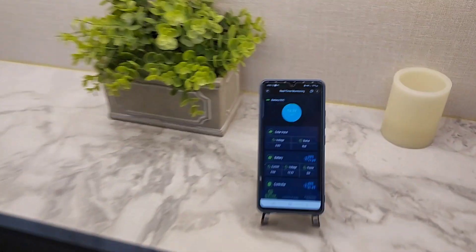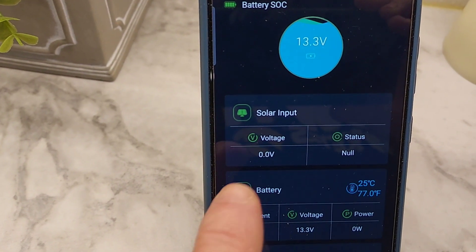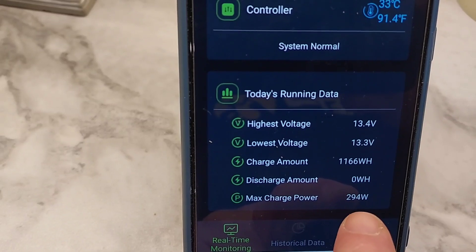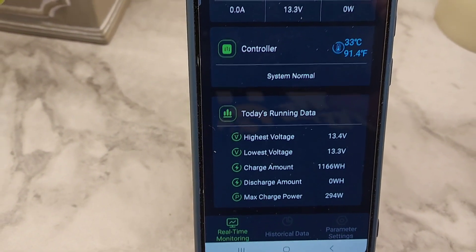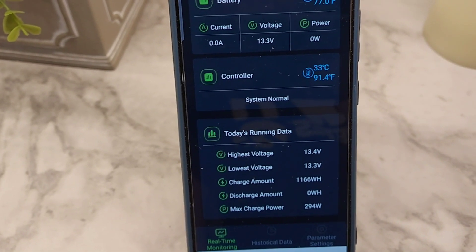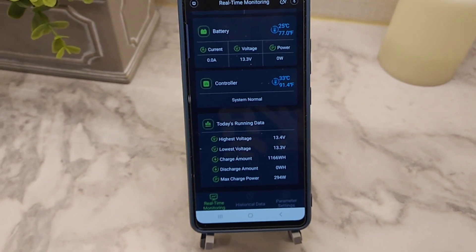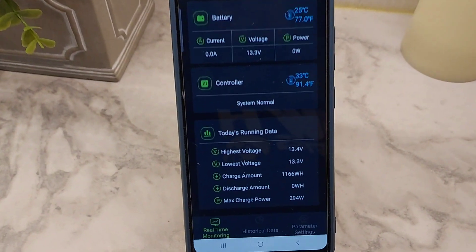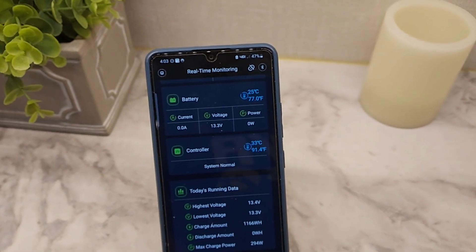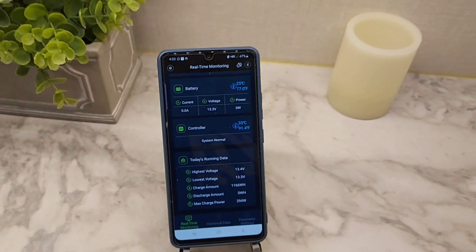To finish up: it took about four and a half hours to get the battery fully charged. I've turned the solar off now. My max wattage today across all three panels was 294 watts. From what I'm reading online it seems to be the angle — two of my panels are angled off a little and they're all flat, so I'm not getting the optimum angle to the sun. At Christmas in winter the sun will be at its lowest point so performance will be even worse. Thanks for watching.